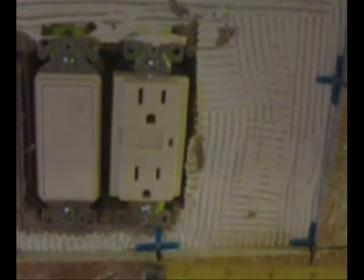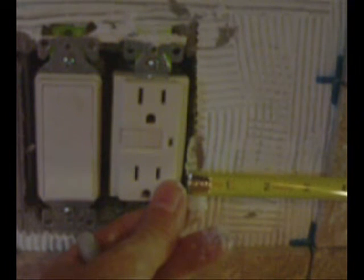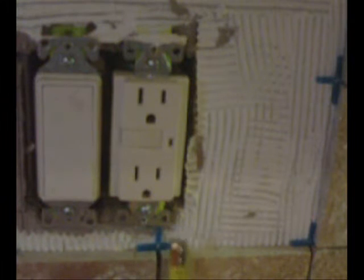So what I'm going to do here, these tiles are 4 inches, and I'm going to have to cut out some, and as you can tell here, I'm going just a little bit sideways over, and this mark here says it's 3.5 inches that I need to have on the right side, and then of course I'm going to go here to the bottom of this, and that's 3/4 of an inch. So I need to cut away, let's see, I need to cut away 1/2 inch here all the way down to 3/4 of an inch to the bottom here.